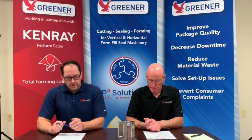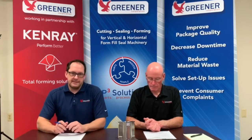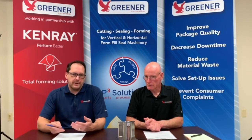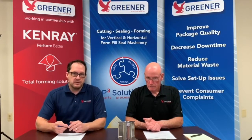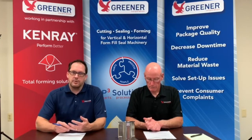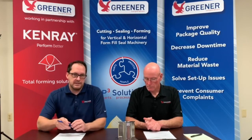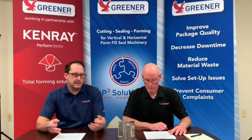So you mentioned temperature as one of the things you looked at. From a sealing perspective, temperature becomes a big deal if it's inconsistent. One of the products that Greener offers to help with this problem is Duratherm. It's the material that the sealing jaw is made from. Duratherm is considerably more of a temperature transfer than standard steel jaws. And what this does is even out your temperature profile from end to end on the jaw.